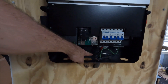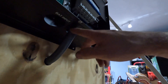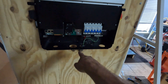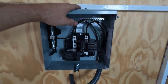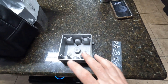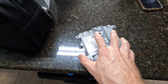I went ahead and got the wiring from the inverter run through a piece of conduit with a little hole right there. I do have to get the correct size fitting that goes here — for some reason this inverter doesn't come with it like the 6500 EX did, so I have to go hunt for those. But neutral, both lines, and a ground are connected and run through this piece of conduit into our distribution box. I already got both hot wires, the neutral, and I had to install my own ground bar because the breaker box I bought didn't come with one.